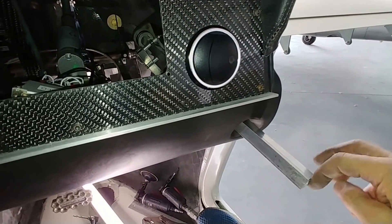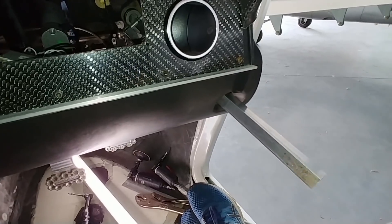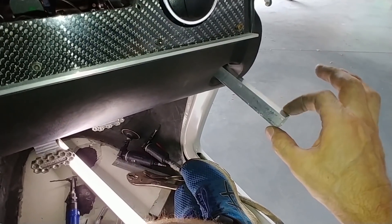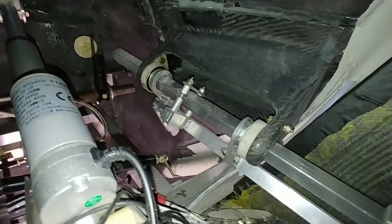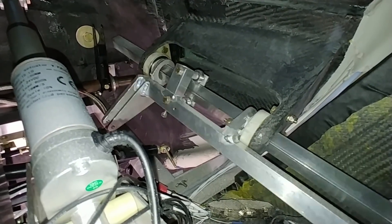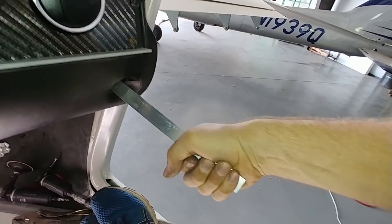Now I've got that done and bolted in. This is just a bit of test 6061 aluminum square tube I'm using, and you can see those rolls are working really nicely — got it dialed in. There's no play in it but it rolls on there really smoothly. Likewise, those bearings allowing the rotation for the aileron control are working nicely and smoothly as well, so there's literally no friction whatsoever on that whole setup. Any friction that comes in is going to be coming from downstream on the aileron or elevator connections, so pretty happy with how the install went.